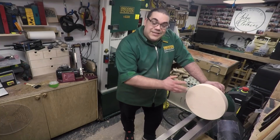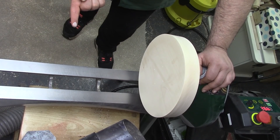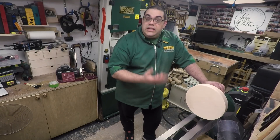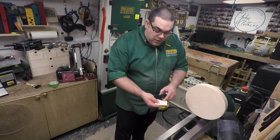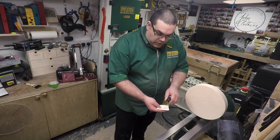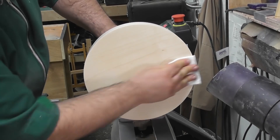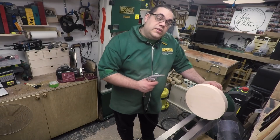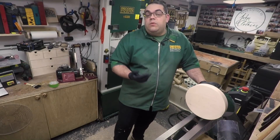So the first thing we want to look at is the fact that it's dusty. I can run my finger across there and I can see all the dust — we need to get that off. That's going to be in the grain and we need to remove it. The best way to do that is with some denatured alcohol or some methylated spirits. When I'm cleaning the wood I'll spray the methylated spirits or denatured alcohol onto a tissue, get a fair amount on there, and then all we want to do is just clean. If you're fortunate to have an airline you can also blast it with air and that will get rid of most of it. So with that now cleaned and the spirit all evaporated, we're ready to move on to the next step.